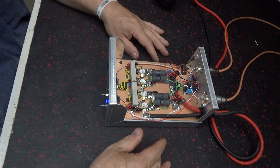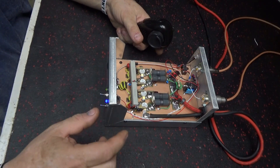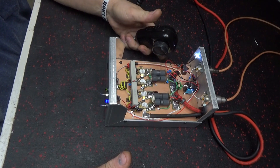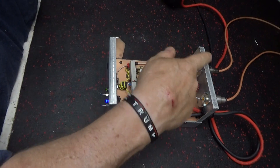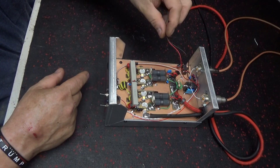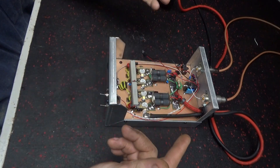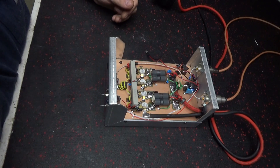I've had a couple that didn't, but anyway — that LED and bias delay is working. Turn it off, turn it on. Like I said, what I can't hear, I have to do that. And if y'all want to put a light in here that shows transmit, that's all you have to do — go from there to there. I could pop a hole in there, and every time the light would come on it would show a transmit light. Very simple.